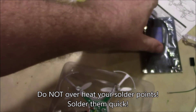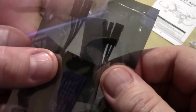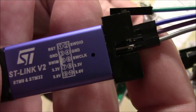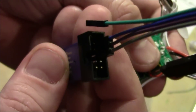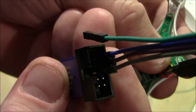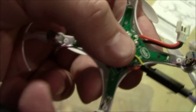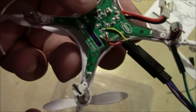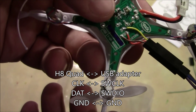Now it's just a matter of plugging in the little cable into my computer, making sure the drivers work, and figuring out which pins go where. On the ST-Link programmer here, you can see I'm using the SW-DIO, ground, and SW-CLK — they're right there, those three. I plugged them into the top three pins on this side. I'll go ahead and put that on the screen so I don't have to say it and get it wrong. Just make sure you get the pins lined up correctly and you should be fine.